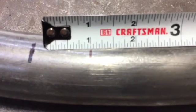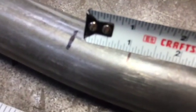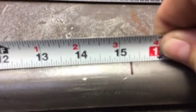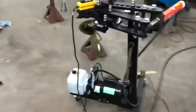On this tube I'll go from that mark and for accuracy I'll line up a ruler at one inch, then measure to add the difference at the end. I need just over fourteen and a quarter, so I make that go up just over fifteen and a quarter. That's where I'll line the die up to initiate my next bend, which will be a twenty-three degree bend. When you have to bend the opposite direction of the previous bend, you have to flip it in the die — turn it one hundred and eighty degrees — because this only bends in one direction.